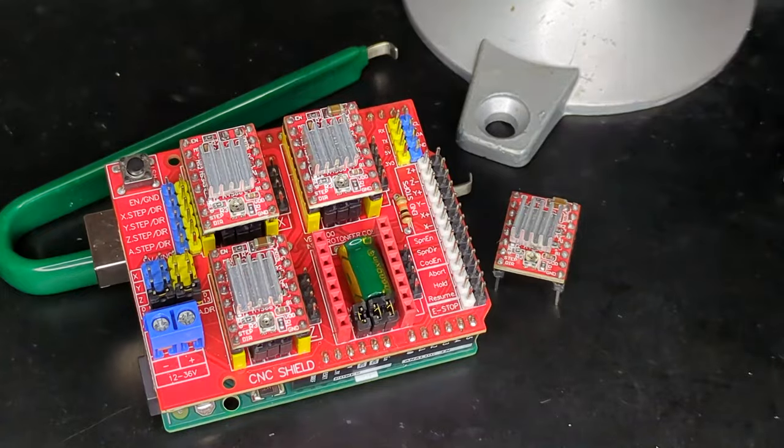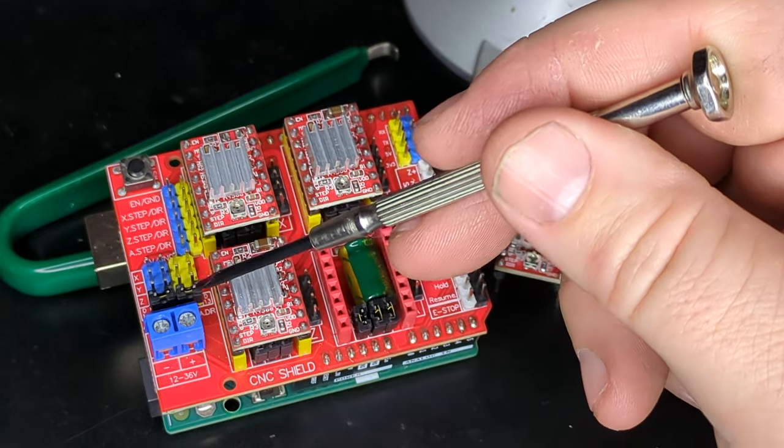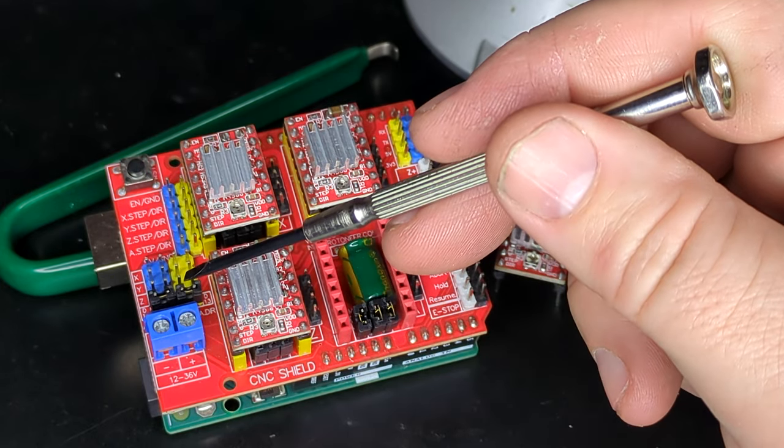Getting them running took a bit of work because all the guides are written assuming you'll be using them for their intended purpose, being run from CNC software that is interpreting G-code. I had to set a couple jumpers on the board. These two, to let the fourth A-channel control an independent stepper instead of mirroring X, Y, or Z.